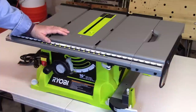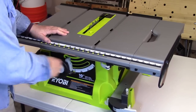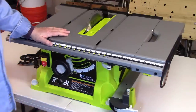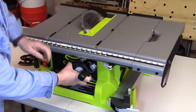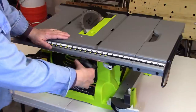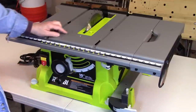The next few steps are going to require the blade to be fully deployed. On the dial it shows you which direction to turn it — clockwise — to deploy the blade fully. Crank it all the way up until it stops. To change the angle or the bevel on the blade, first release the bevel control lock, push it all the way over to 45 degrees, and then lock it back into place — now you're at 45 degrees to the table. To reverse it, release the bevel control lock, bring it back over to 0 degrees on the bevel control scale, and lock it into place. Now you're at 0 degrees, or 90 degrees to the table top.